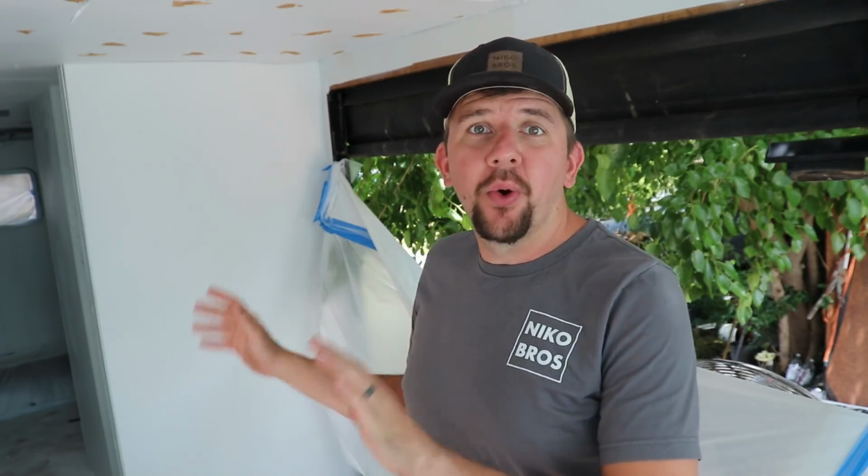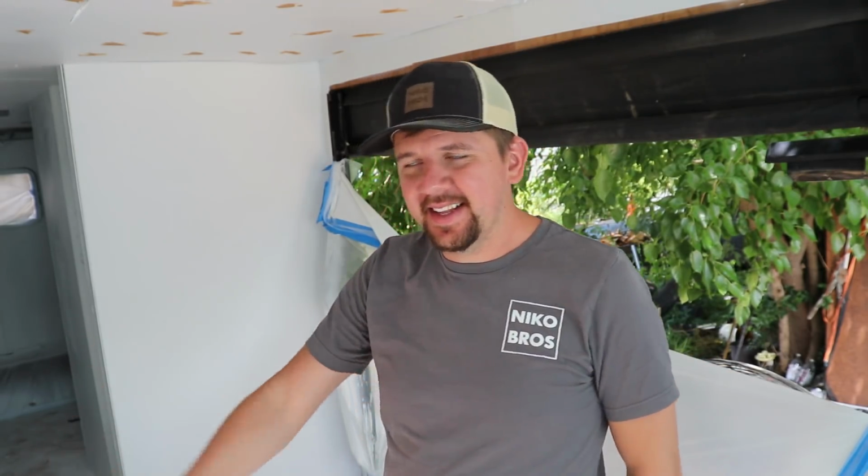Okay, so I basically got the ceiling all patched up for now. I opened up my little vent, so let some fresh air come in here, let it dry quicker. But while that's drying, I'm gonna go ahead and work on the cabinet doors themselves, get the handles apart, start sanding them like crazy, and getting ready for primer, so that I can prime the doors and the ceiling together. Because if I get my gun dirty, it's kind of a pain in the butt cleaning and stuff, so I might as well multitask and put it all together. Let this dry, let's get that done.